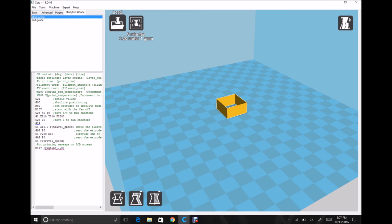And once those have been homed, you have to move to a position away from 0 enough that it would think that the sensor is over the bed. If you do the home automatically on the controls of the unit, it puts it out 150, 150, somewhere in there, putting the sensor in the center of the bed, not the nozzle.